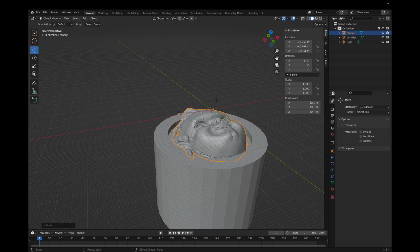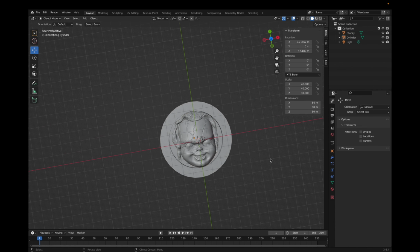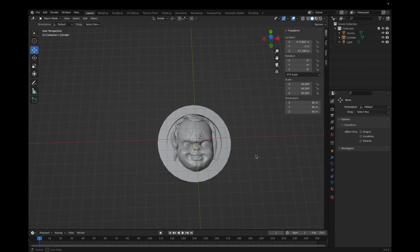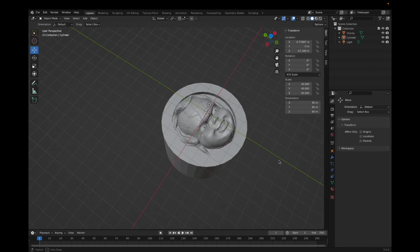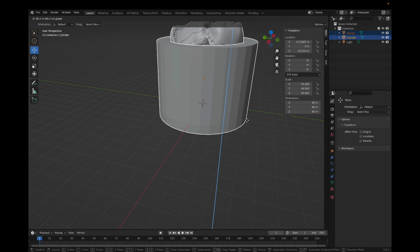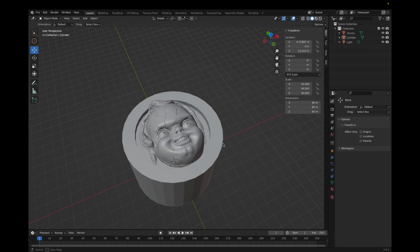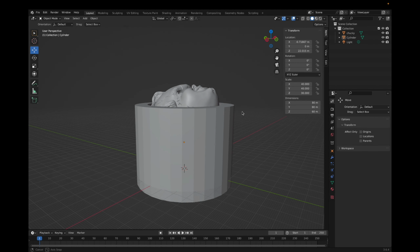Okay, and that's going to be 4 centimetres top to bottom. It's going to be overly deep, so it's going to be 3 centimetres deep. Yeah, that's perfect. Just the reason being on that, I'll just quickly explain. I don't know whether you're 3D print dudes, but when I push it into the impression in the sand, it gives me something I can lift out, you see. Yeah. I can pull out a lot easier. And also, if we wanted to add more silver weight to the piece, we can by going a bit deeper.